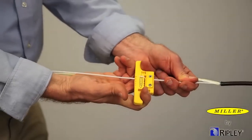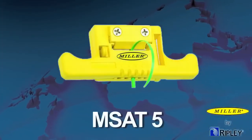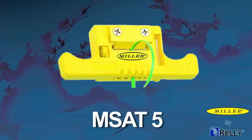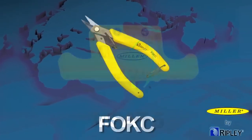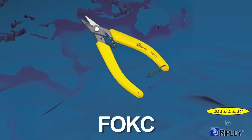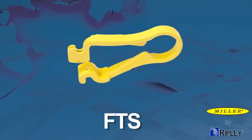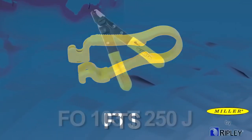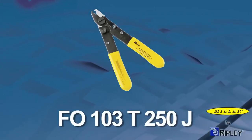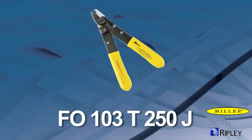Ripley also offers accessory tools for further preparing the cable. The Miller MSAT 5 mid-span access tool allows for easy access by shaving a precise opening to prevent fiber damage. The Miller FOKC fiber optic Kevlar cutter can be used to cut Kevlar strength members in the cable. The Miller FTS fiber tube scorer can be used to end score the buffer tube. And finally, the Miller FO103T250J tri-hole stripper will remove the 250 micron buffer coating.